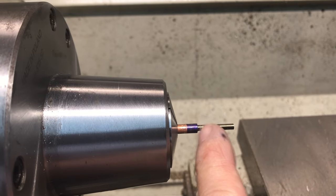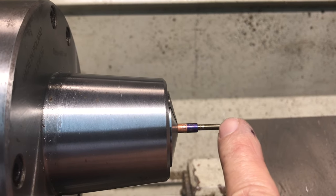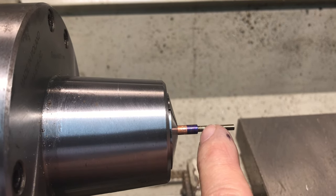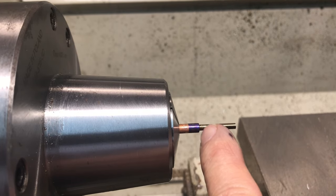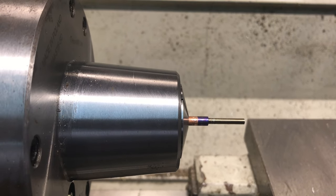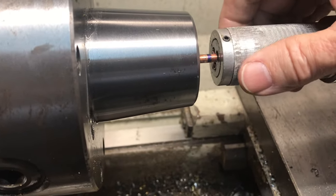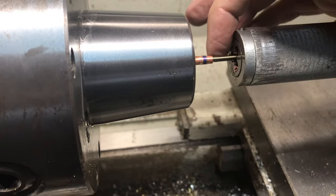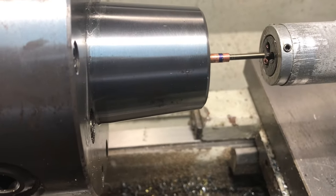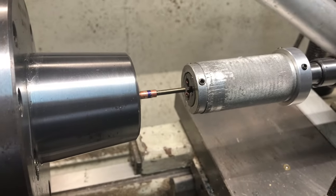With the 3/16 inch copper tube cut off at the proper length, I've crazy-glued a number 32 drill inside there to give it some support for the threading. I just spun it, filed down a little ramp at the beginning, and marked an eighth inch portion so I don't over-thread. I use the inching function on the lathe, advancing it by hand. My point was to keep this about an eighth of an inch of thread — it looks like it's just about the right depth. Using the tailstock threading die and fitting the regulator and the little steam pipe to the steam header here on the front.